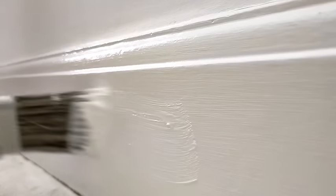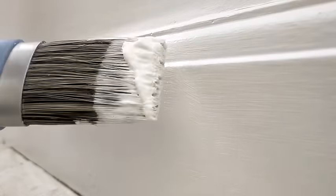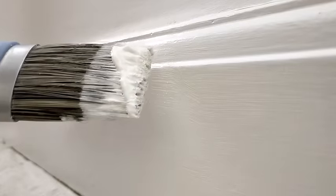Another way the paint can run is as it's starting to dry. If you then put a thick amount of paint on top, that can start to sag — sitting on slightly dry paint which you can't rub out. So remember to lay the paint on and spread it out.